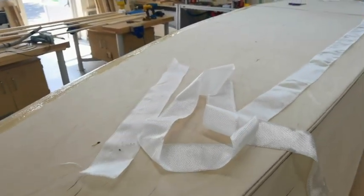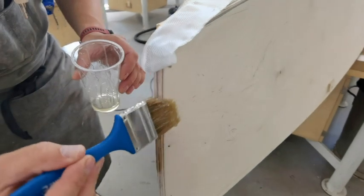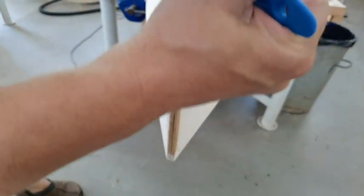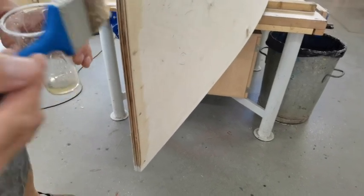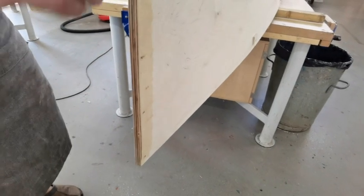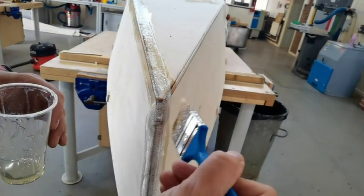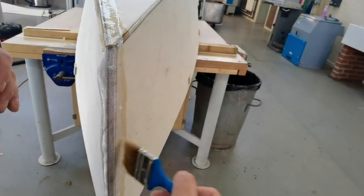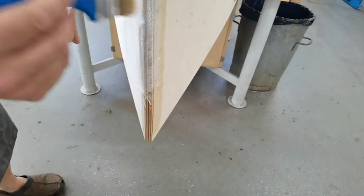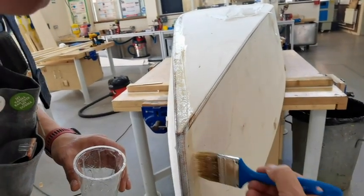I have just enough to do the nose on this, which will be perfect - I measured it out thinking if I get half of it done that'll be brilliant. I've actually trimmed the nose down - I've got the belt sander on it and did that. So I'll wrap down here, stipple it on just to get a tack going on that bit there, get it coated, wrap that down onto it like that, and then brush it into it. It holds it together better, doesn't it? It seems to do what I want it to - I've not struggled with it. A little bit short there - I'll cut a little piece off and overlap it. It's quite forgiving actually - I thought it'd be more difficult than this.